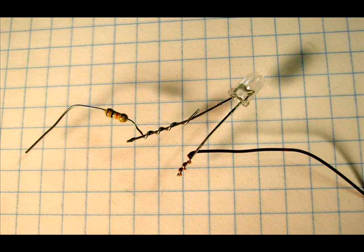This is a little tester — just an LED with a 10k resistor on it, so we can track down some signals in our circuit with this.